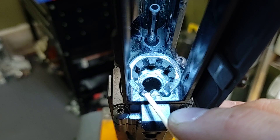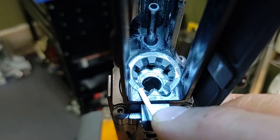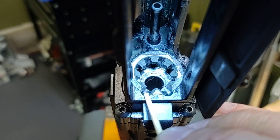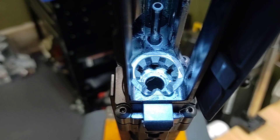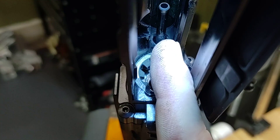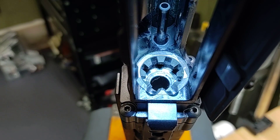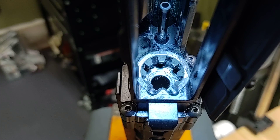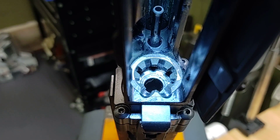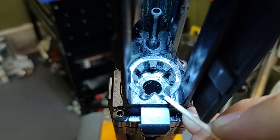In this particular interface, you can also see on the edges right here it has a visual overhang. I don't like to see that. I have it here and a little bit right there; the right sides are fine. This means that this particular barrel may be a little over-torqued in that receiver, causing the whole thing to clock slightly as the barrel nut was tightened. I'll check that when I remove the barrel — make sure the index pin isn't broken, or the upper receiver index pin notch isn't oversized or peened out. Nonetheless, this is what I like to check.